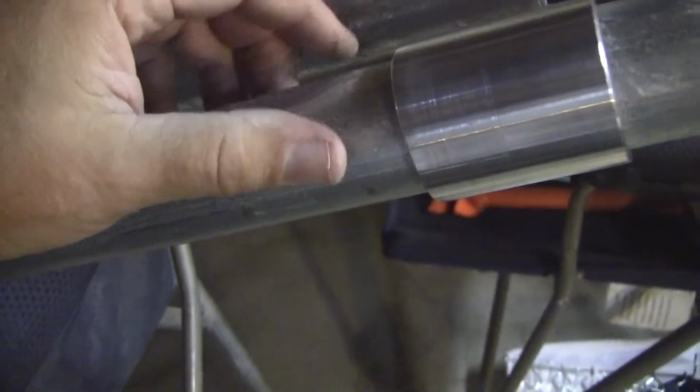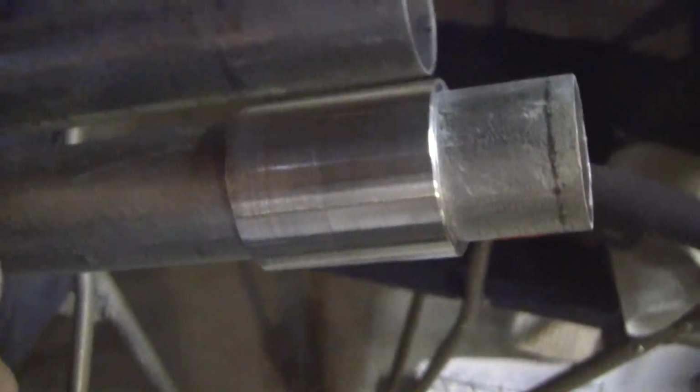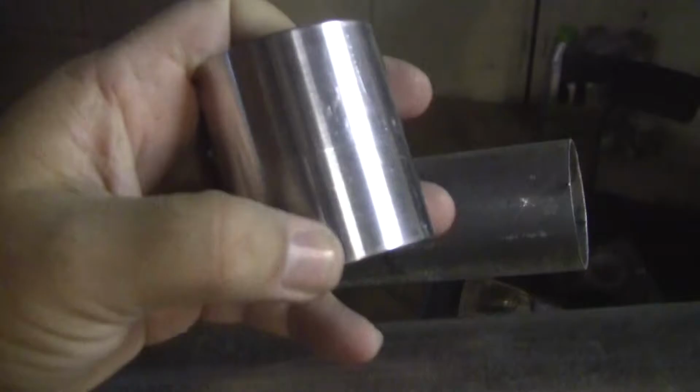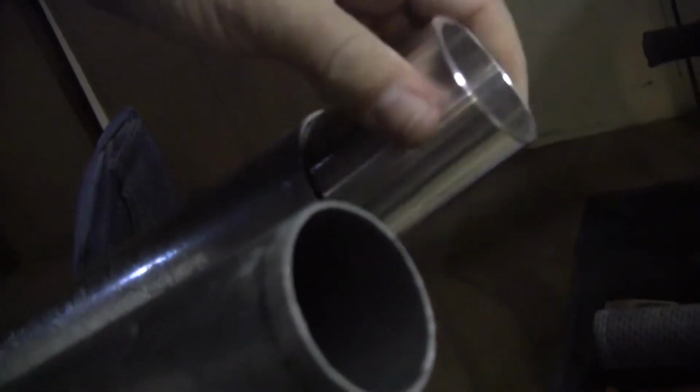They're just conduit. Now, one thing I learned with the other piece that goes on the inside is there's a weld seam here, I don't know if you can see it on the outside. It makes a ridge on the inside, so I have to machine a groove in the other bushing that goes inside of there. Well, that would be this one. So this one's a little looser. If I had put a groove in it first, because I did an experiment with it earlier, but I machined all that off, then it would have fit tighter and it would have straddled that groove.